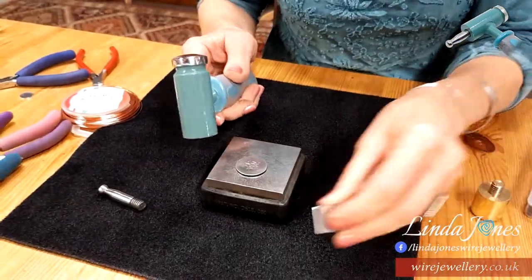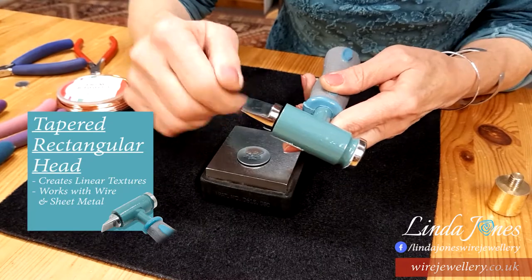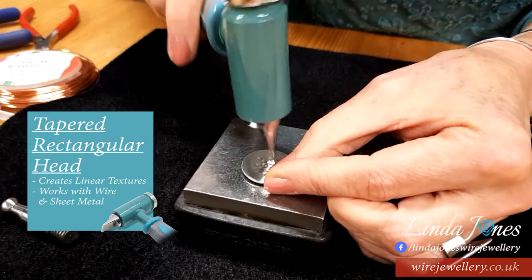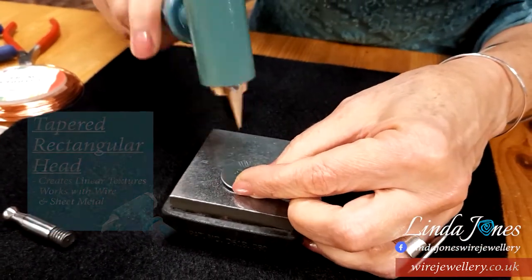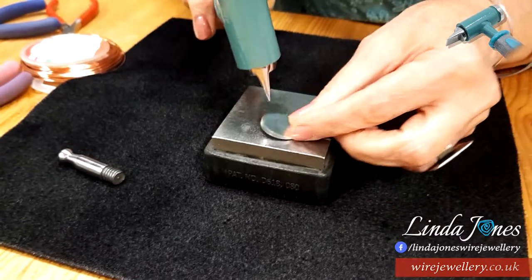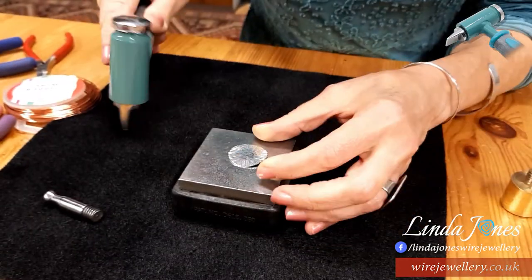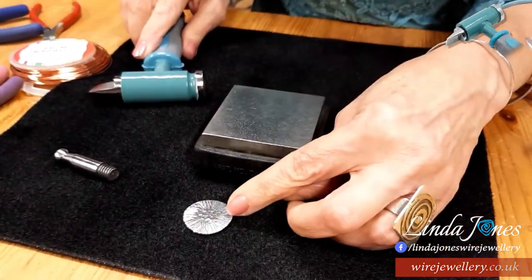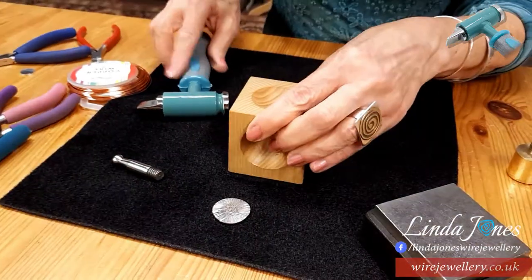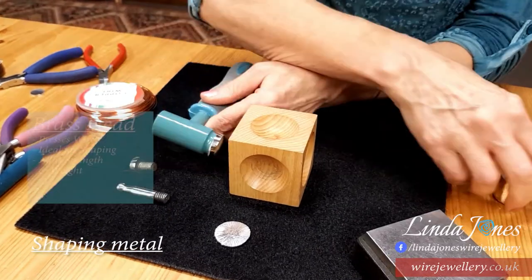That is the pick head, which is like a pickaxe type head. It's quite sharp, so for wire you would need to use this on thicker wires, but on metal it's good. You can see those little rays appearing on the side there. As you hammer things, you can see it sort of warps the metal a bit. So you can either flatten it with your nylon head, or you could dome it. Now I'm going to remove my texture head and use the brass head that also comes with the Whammer.